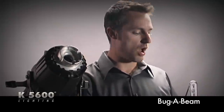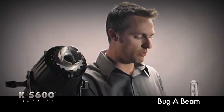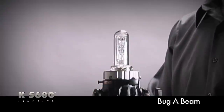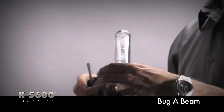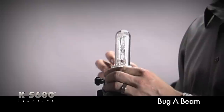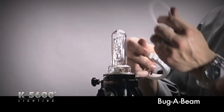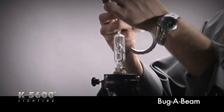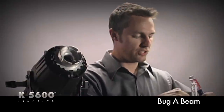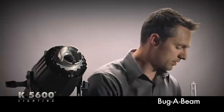Next, you want to move on to your Joker Bug 400-watt head. This head has the optical beamer removed. What I'm going to do now is remove the retaining screws which hold down the Joker Bug ring. Same flathead screwdriver — you're going to insert these right here. A couple twists on all three screws, and now I'm removing the Joker Bug retaining ring. This retaining ring holds the Teflon washer, the clear glass beaker, and there's actually one more Teflon washer in here. You want to make sure that you take off all these parts and set those aside.